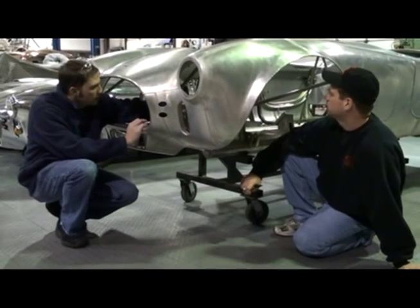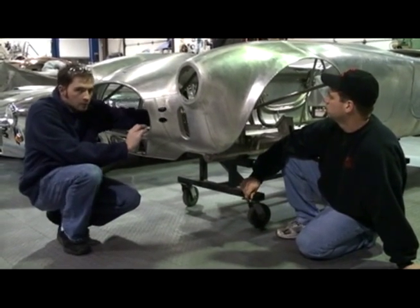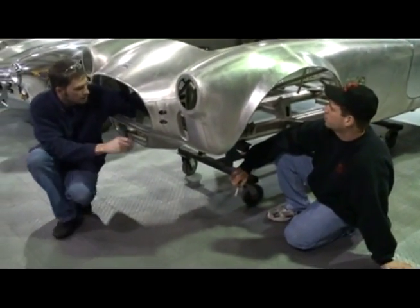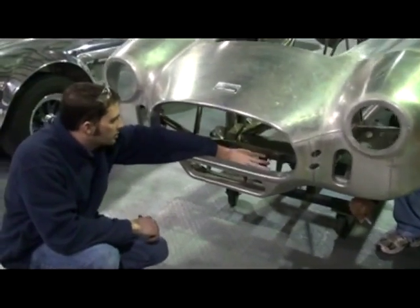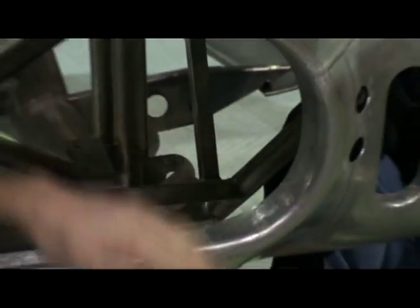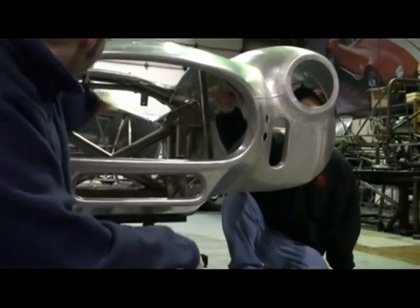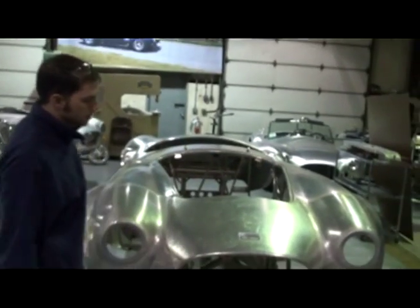It's going to be good, and we need to go from there to here to strengthen that, because now it's just flapping in the breeze. We have to leave the radiator all attached to the main frame, so we have to tilt away from the radiator also — that will allow us to do that. It also will allow us to keep the oil cooler stationary. We're going to cut it about here, then weld the tube there to there to keep this from flopping around, and cut it off right on this three-quarter tube. That'll allow us to still mount the radiator but be free of the radiator, because right now the radiator is attached to that.